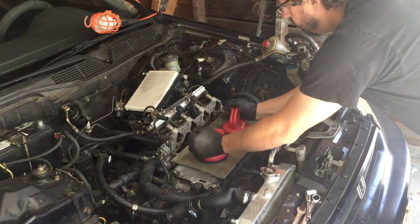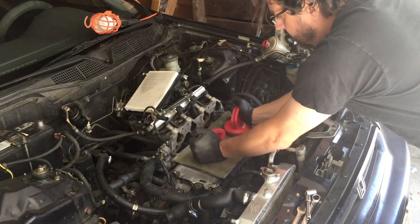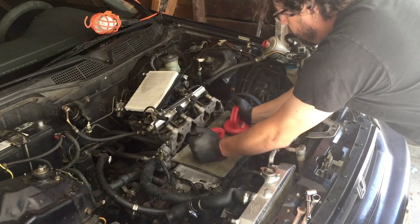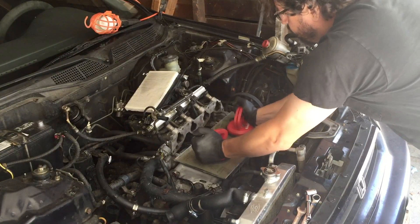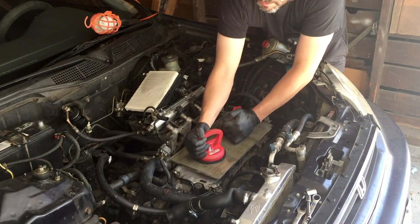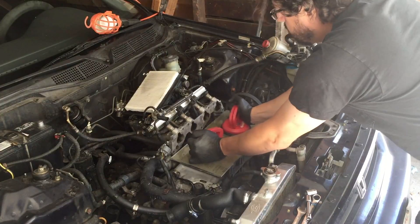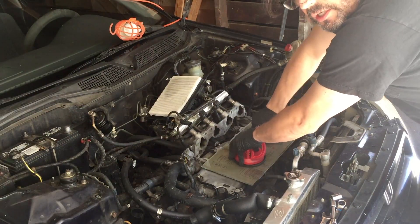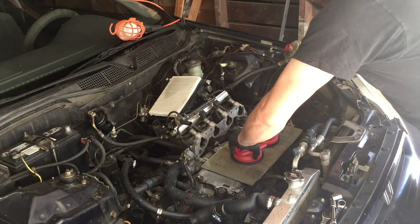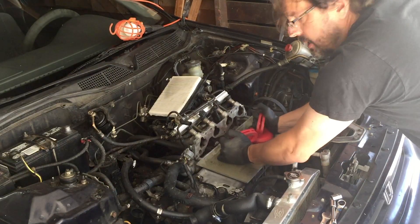I basically have about two inches to move the glass back and forth to cover the whole surface. You can go in different directions, switch things around to change the displacement of pressure and change your angles, then keep moving it around so you get a good even pressure across the block.